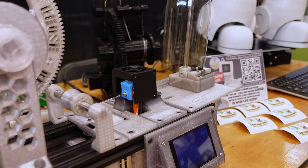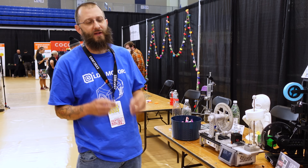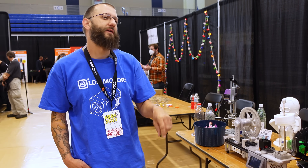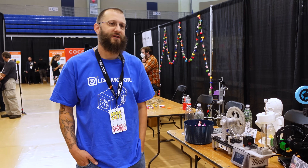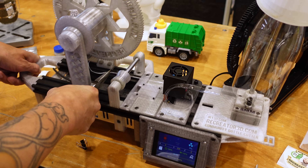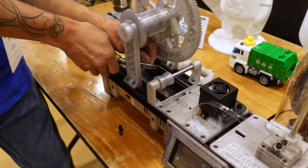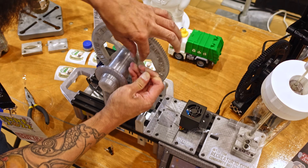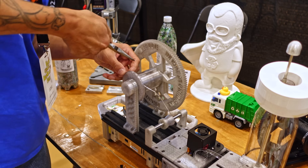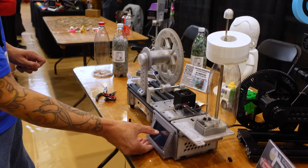With pulltrusion, you're pulling it through a hot end and it's actually reforming it into a straw-like material. Rather than making it into a molten state and working on proper diameters, this uses the diameter of the nozzle. The PET material doesn't really get molten until 255°C, so it's just reforming into more of a straw-like material. We do have a hollow core, and a lot of people question how we can print with that — we just bump our extrusion rate a little, about 130%.